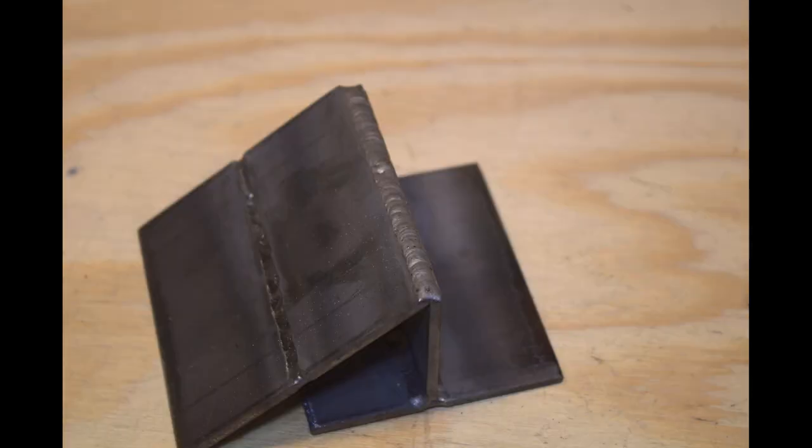I by no means know what I'm doing with the TIG welder. My experience is with stick and MIG for many years. I got this welder a few months ago and this is the first time I've ever used a TIG, so I have less than one tank of gas through it so far. One thing to note: with this torch being air-cooled, it does get hot pretty quickly, so keep that in mind when welding. Give it a break every now and then and let it cool down.